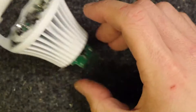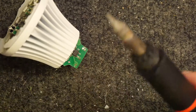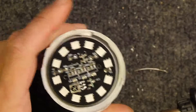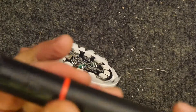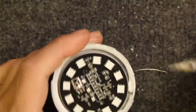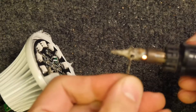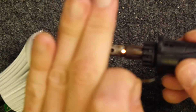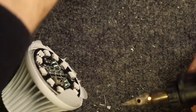Let's go get some tools — and when I say advanced, no more advanced than a soldering iron. I'm back. I've got my trusty gas soldering iron. Here in the back office we do have a full range of soldering and surface mount equipment, but I really like these gas irons — they're very powerful and get very hot. The only downside is this little exhaust hole here: if you've got your finger over it, you'll feel a lot of heat and burn yourself. I like to reserve those holes for working with heat shrink.